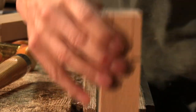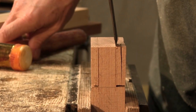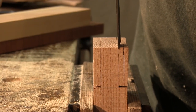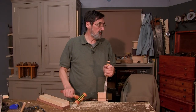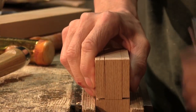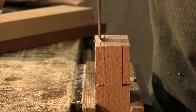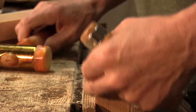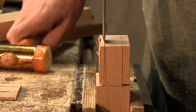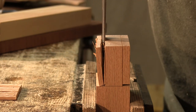I'm going to turn this around so the camera can see it. Over a three-inch width, I go right onto my gauge line — watch here, this side is splitting exactly to my line. So I know that somewhere in the middle this is likely to change back to the other side. Now I'll take that midsection off, the whole outside section, so I can look into the grain.